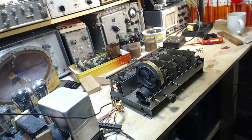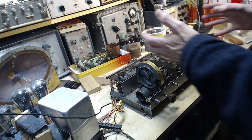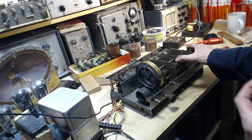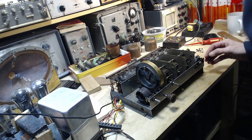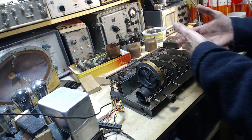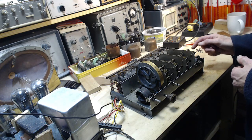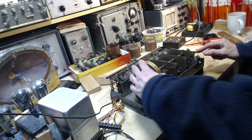You know what, these are easy to find, because this happens on all radios, or can happen on almost any radio. The tuning capacitor is usually kind of exposed, and people reach in and grab the radio like that. Maybe I did this. I don't think so, though. And when you reach in, next thing you know, you've squeezed the plates, and that's what's happened here. Or, you know, it's been banged, or who knows how it really happened. But wow, that's...